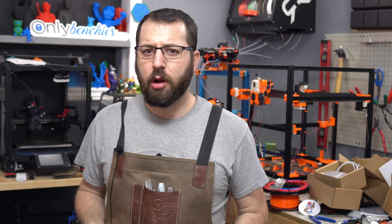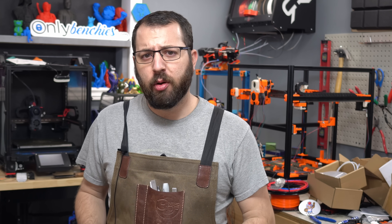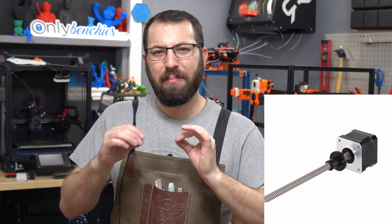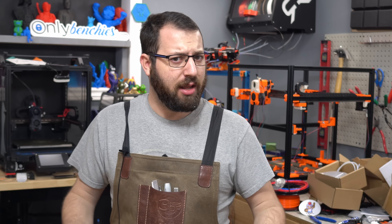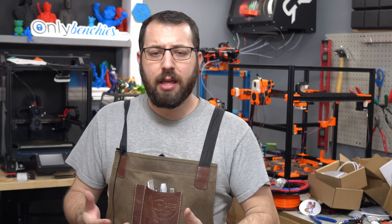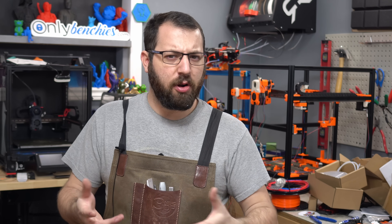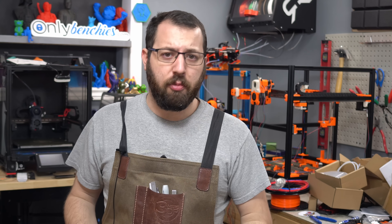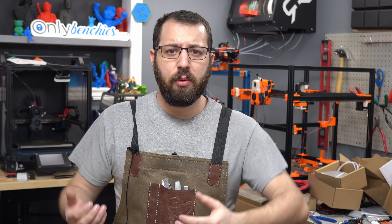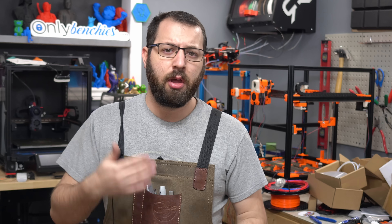This isn't the first time the Voron design team has worked with a company to bring something to market. The Voron V0.1 has an integrated lead screw NEMA 17 pancake motor for the Z system — that didn't exist before the V0.1. The team reached out to stepper motor manufacturers to get it made for their printer design. The Revo Voron follows the same model: we wanted a product, reached out to a company, said here's what we want you to make, and if you make it, we will buy it. And like previous endeavors, this is an open source design.